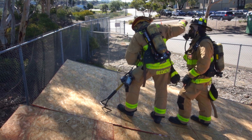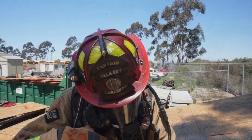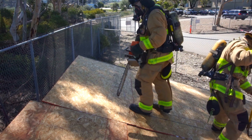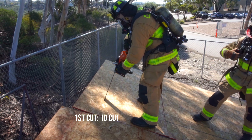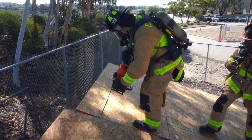The sounder attempts to feel the rafters in the area where the hole will be cut and indicates to the sawyer. Ventilation crews should communicate with interior crews. The sounder then sounds down and the sawyer comes up. The sounder does not grab the sawyer and they work in sync without stepping the hole and avoiding cross body cuts.